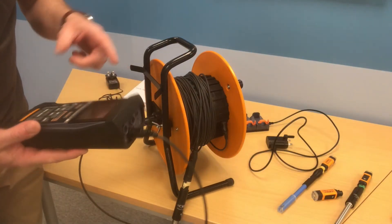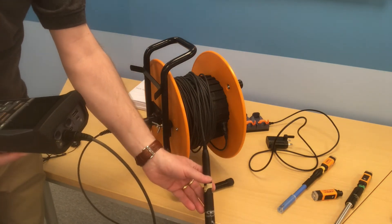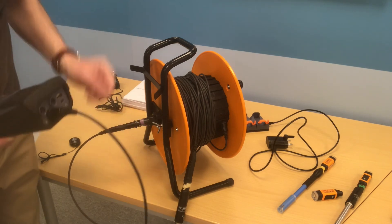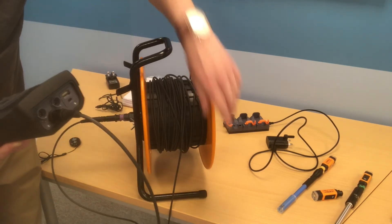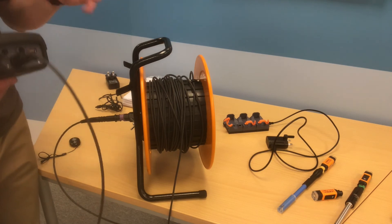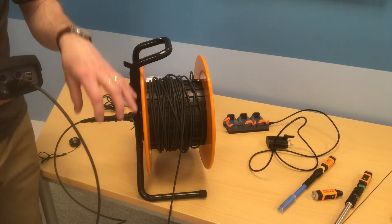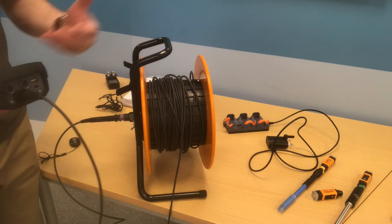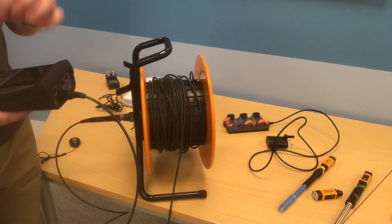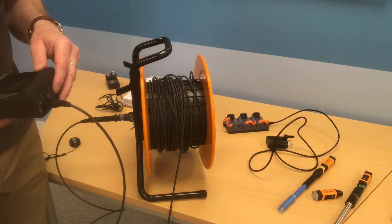If you decide to use this out in the field, we have the option of a reel with a long length of cable. We've attached the turbidity probe to the long cable and the meter to this device, so we can extend the probe into the water and the reading is constantly displayed. We also do sondes — single devices to which you can connect several probes — up to 100 metres depth, which are weighted because of the length of cable and the buoyancy that creates. It's completely interchangeable between the probes used in the laboratory, connected singularly in the field, or even to a sonde. So it's a very cost-effective way of doing it.